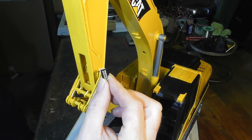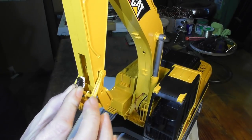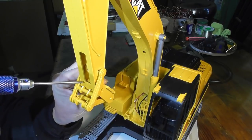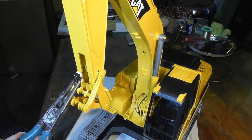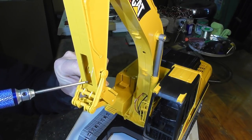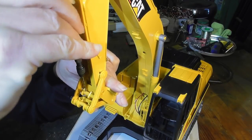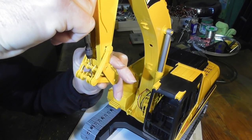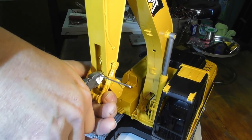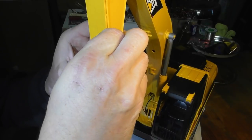I'm not sure yet. Rather than mount those on the outside here where they're not going to look terribly good and potentially get knocked when I'm digging or covered in dirt, I'm actually thinking that I want to put them inside here if I can, and to use this bar here to actually push the switches with. I would rather not remove any of this material here because I think it's giving strength to where the bucket attaches. So if the microswitch is going to end up somewhere like here when we're at the bottom of the travel, I'm going to want a way of getting this arm to push something further up. So what I'm thinking is if I drill a hole as close to parallel as I can, somewhere about there, and then push a piece of scrap metal rod into it — that's going to push down here and at the other end I can actually mount something all the way over here.